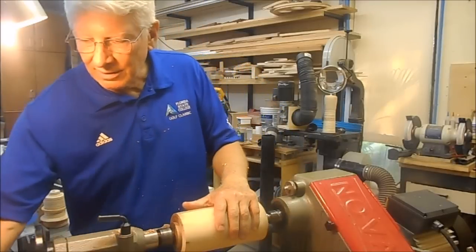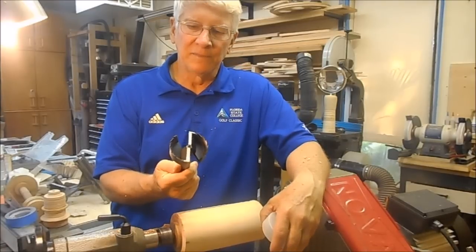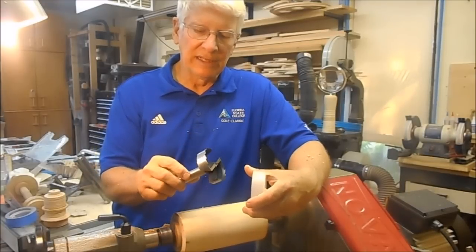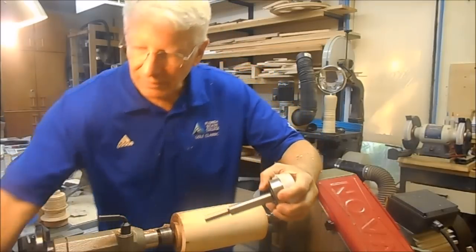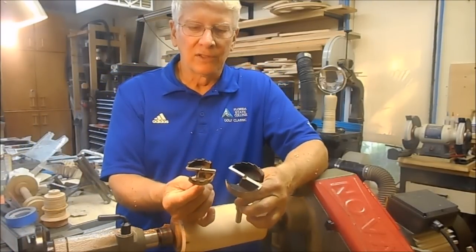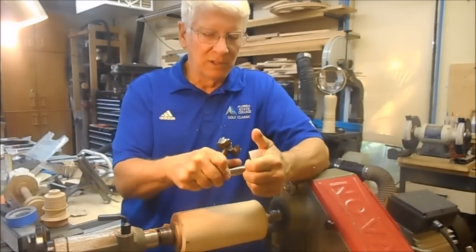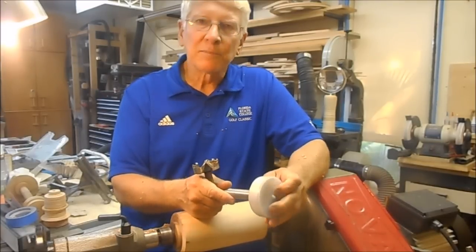To speed things along, I decided if I could get a start on the opening part, I bought this 2 7/8 inch drill, which is just a little smaller than what the hole required. So I'm going to drill out the first inch or so with this, whatever the measurements required, I can't remember exactly, and then follow that up, going down to the bottom as the instructions say with my 2 1/8. So that's going to help me, I hope, speed things along, and we'll see if my lathe wants to drive this all the way in. I haven't done that yet, but we're going to give it a try. Obviously running on a low speed to get all the torque I can. That's the plan for the day.